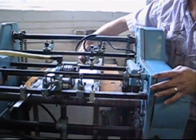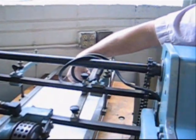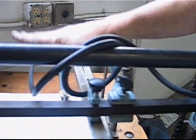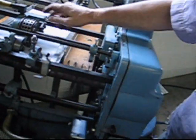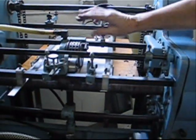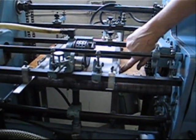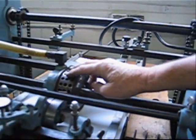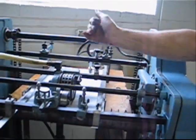Your table height adjustment is back here. It's just a simple bolt right here that you adjust in or out, and that'll adjust how high or low you want the table to ride. You want the sheets to basically be about maybe a half inch below this metal finger here, and it will feed up with the air blows. It'll feed up to the suction wheel — it'll grab it and feed it in.